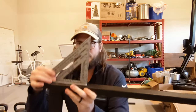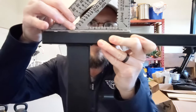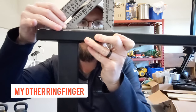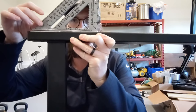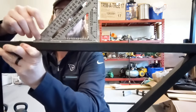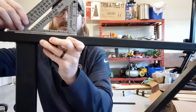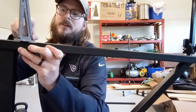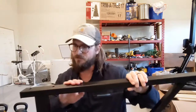I want to give you some perspective to show you how the surface is not flat. If I put this square over that hole, you can kind of see over near where my ring finger is — there's just light showing through there. You can even see it wobbling and balancing on that mound. Down here it's pretty much flat, but up near the hole there's rotation. It's going to want to pivot about that mound, so we're going to keep flattening down these holes.